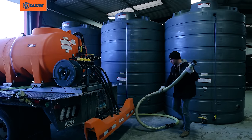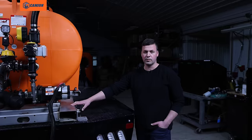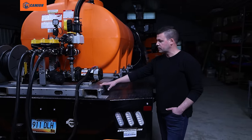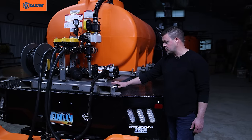With us here in our video we've got one of our flagship sprayers, the T-Series. First off, for the stainless steel frame, you want to have a rust armor frame. We're dealing with some corrosive product in different areas, so that's really important to have a stainless frame just to eliminate as much of that corrosion and rust as you can.